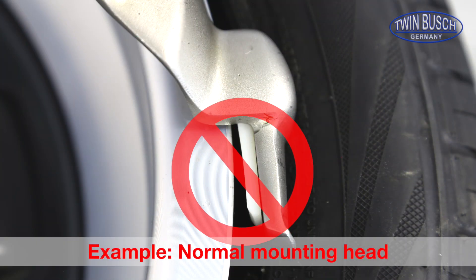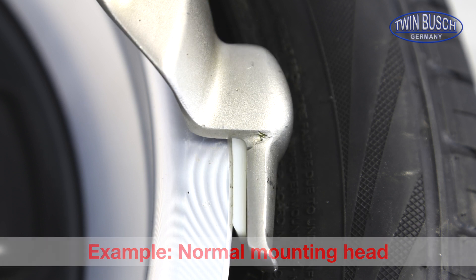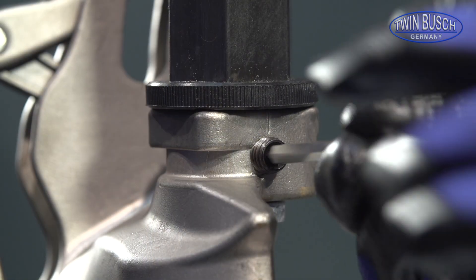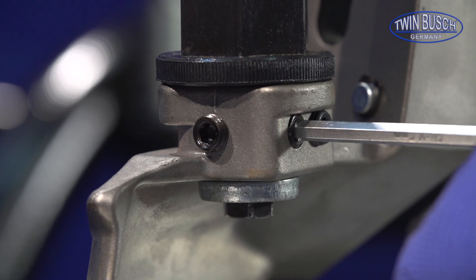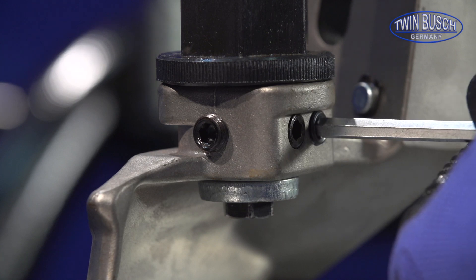The large slider should fit smoothly laterally on the rim during operation. If the slider fits smoothly, first fix the position with the lateral headless screw to avoid unintentional movement. Then tighten the two front headless screws equally. The set angle is thus again secured.